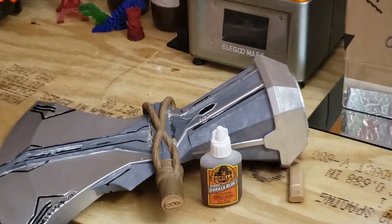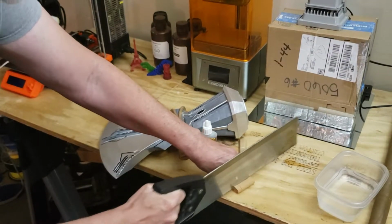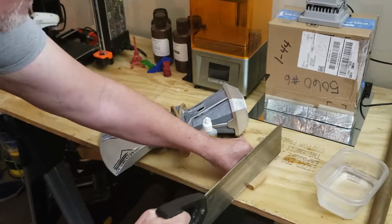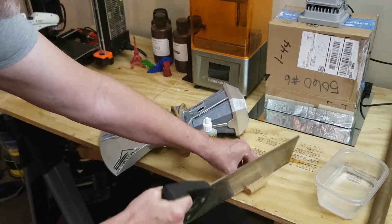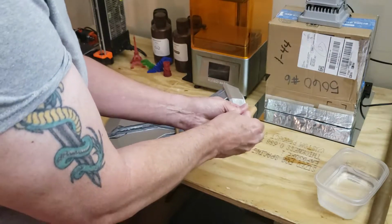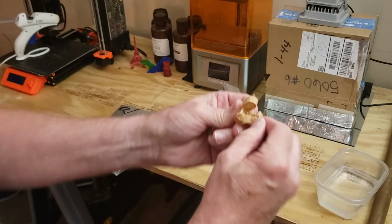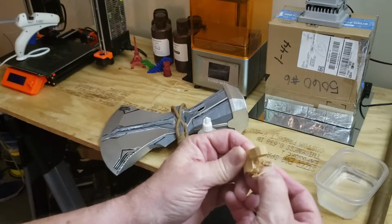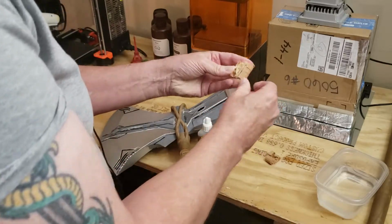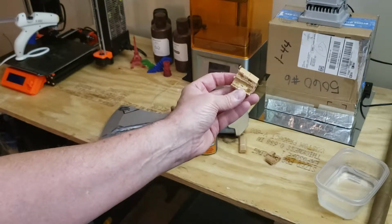So let's go ahead and take a look at that. Hold on here. Let me zoom out a little bit. There we go. So what I'm going to do is cut this open, and we'll see just how far it expanded. Yeah, didn't want to cut, does it? There it goes. Right, this wood is not good at all. So let me break this open. And as you can see, the hot glue only went about this far in. Not very far. The expanding glue, as we know, if I can get it open, there we go. So you can see that this expanded all the way up this way, all the way that way. And I got 1.5 inches of coverage that I wouldn't get with the other.